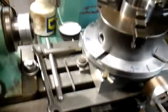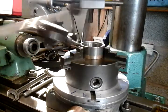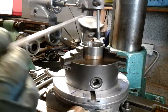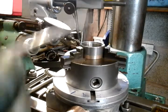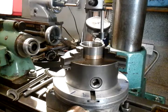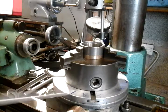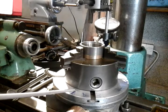I've set my chuck up on my own made rotary table — that's another project for you. Where I'm up to now is I've just set my blank up in this chuck on the rotary table. I can't see my clock from there, but I've set this up and I'm within half a thou concentricity. So my spindle is set in the centre of this bore now. I'll take my clock out — I've set my degrees to zero on my rotary table. I'm not going to be using my rotary table as such to get that material out; I'm going to be doing it using coordinates.